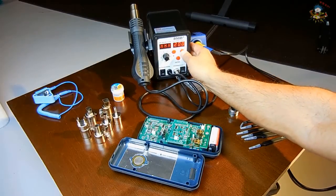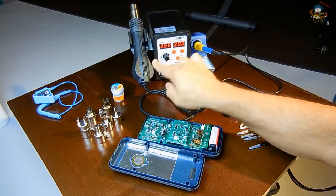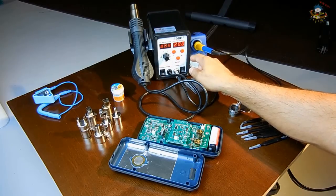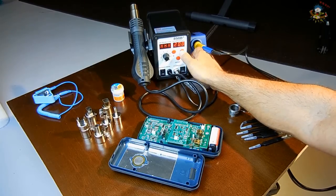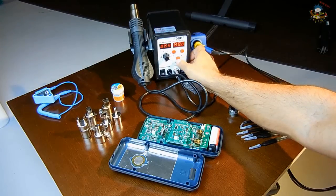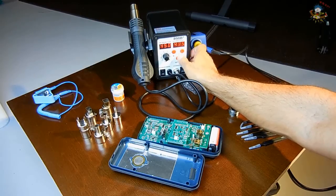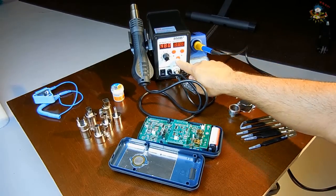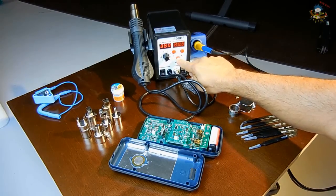If I wanted to go higher, I could push that button to change the position. This is currently set at 350 degrees Celsius for the heat. The accuracy — I'm not totally sure it's exact at 350, but it's close enough. I can go higher, and the maximum for the soldering iron is also 480 degrees Celsius. It's 480 for everything. Let me turn the soldering iron off — don't need it. Let me put that back down to 350 Celsius and we're good to go.